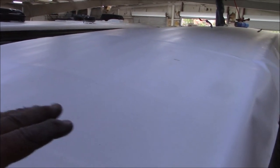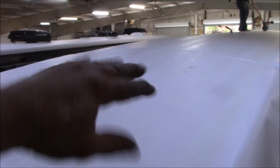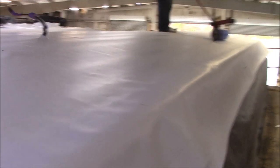Well, we got the roof all rolled out. This membrane wants to lay two-dimensionally. So you got this coming up this way, then it levels off, then it goes back down, and it's got camber. So we're gonna have some burps on here. So we'll bring it over on the shoulder. It's a structured membrane. Structured means you can see the weave in there. That's a part of the structure, so it's really rigid. So we'll straighten this out, and we'll put a little weld in here. We'll pull it down and tuck it.